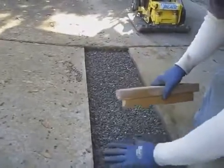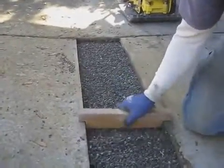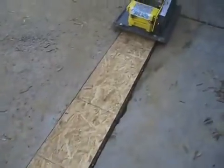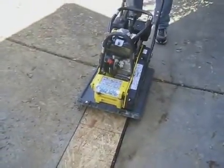The rock is then leveled using a screed board. The ZeroPave pavers are laid in place and compacted. If a rubber-plated compactor is not available, plywood can be placed over the pavers and a standard compactor used.